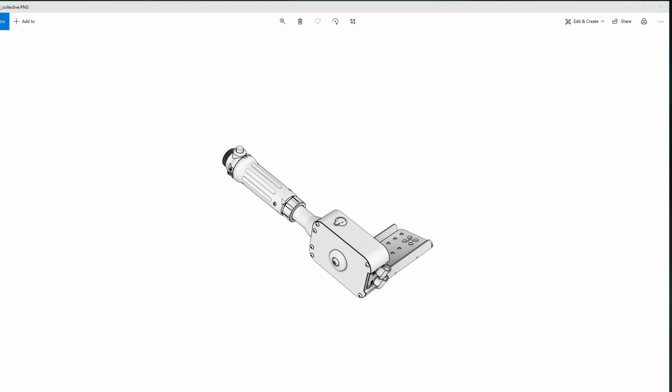So like I say, you're going to need to adjust this periodically, because it will become looser over time. Now, here is the thing. I've had to do this 3, maybe 4 times now. The only thing that worries me right now is, if this nut is slowly working loose, then that's okay. If this nut is not working loose, or the corresponding one at the bottom, then with wear and tear, what's happening inside here is that the little clamp that is actually pressing on and exerting pressure to stop it moving by itself under gravity is slowly wearing. Only time will tell which one of the two things it is.